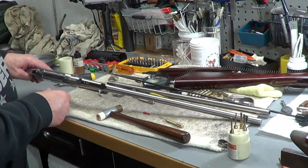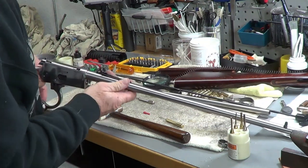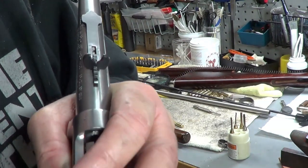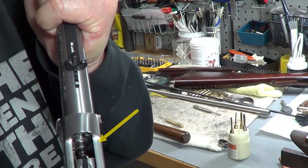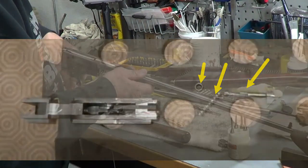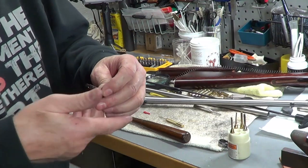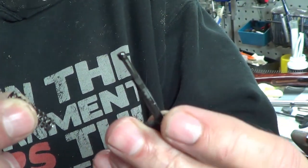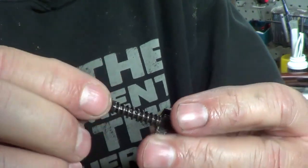There's a problem with this little bolt that everybody seems to have — the ejector will come off now, and there it is. As I open this up, you're going to see the ejector loose right there. There should be three pieces with that, so I want to make sure and get all three when this comes out. There's the spring, kind of the follower, this little collar, the spring, and then this is the feeder. I will be polishing all those up and smoothing any rough edges.